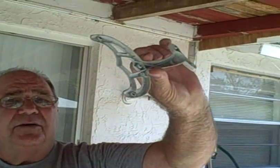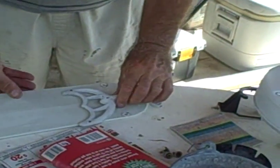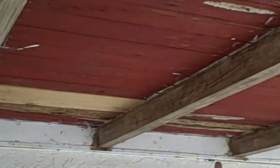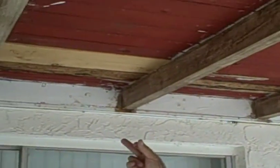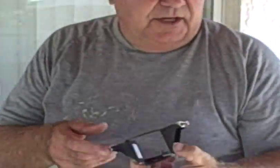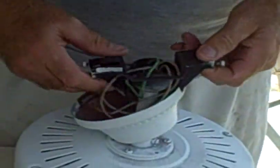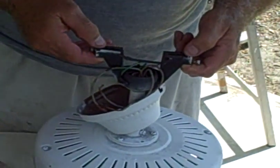Primarily what we have to do is take the blade holder here and reattach it to the blades. And then we're going to have to suspend a bar up here — I've got a piece of 2x4 to do that. I'm going to make a brace that goes across this way. And then what we'll do is the fan hanger bracket, which is this, which goes and holds the fan up like this, will attach to that wooden brace that we're putting in up there.